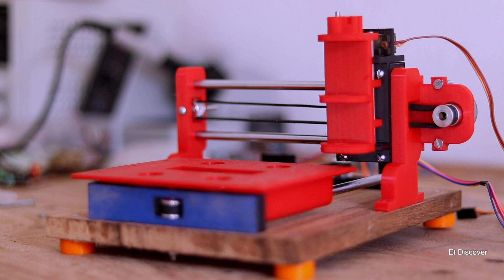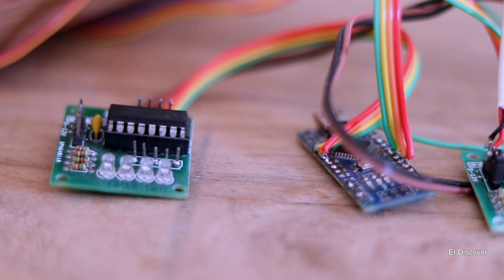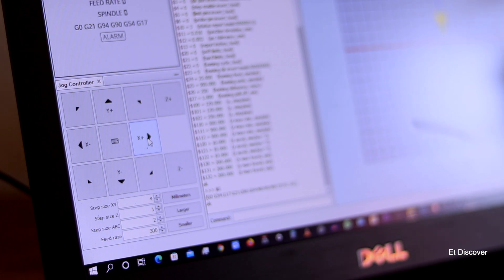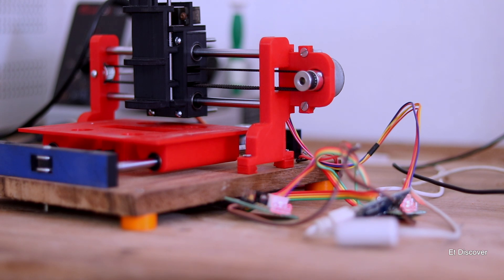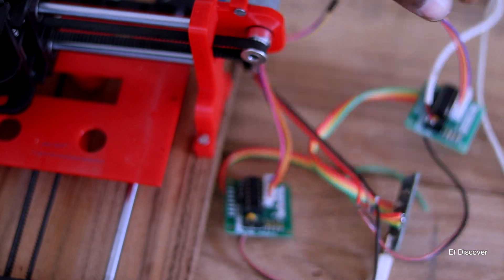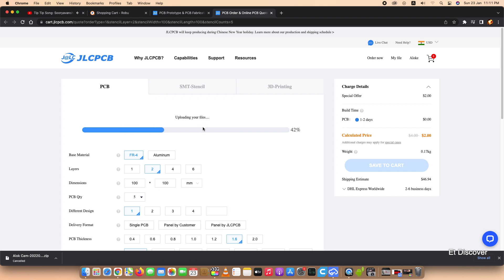Now it's time for the electronics part. We need two ULN2003 motor driver ICs — one for each stepper motor — and an Arduino Nano. I connect everything to the CNC and for the first check I connect a USB cable, testing with my GRBL G-code sender. Everything is working like a charm. But the wiring is very messy, so I designed a proper PCB for it and ordered it from JLC PCB.